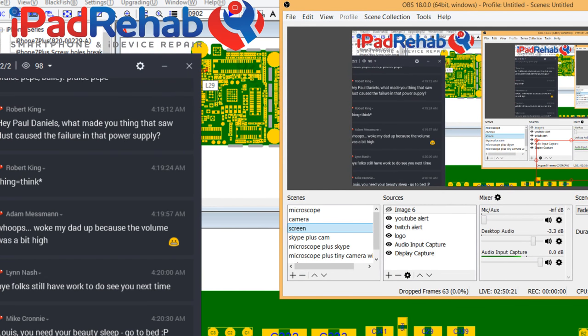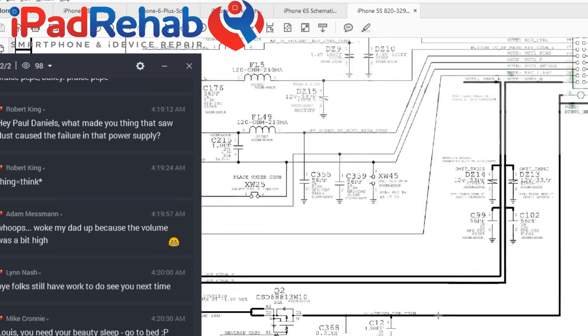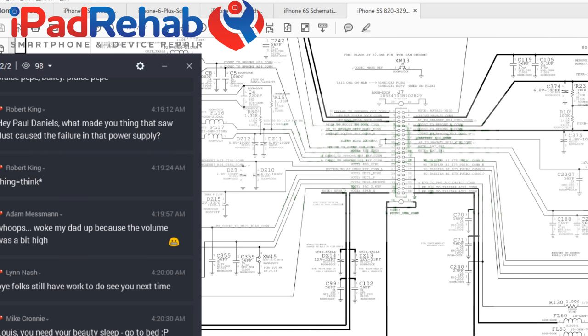So result here is that this phone started out with a straight up TriStar problem, changed TriStar, and the phone charged normally at the beginning. Then we pulled TriStar and we installed one where we intentionally deleted the 3v0 accessory power. Let's look at that screen. The 3v0 accessory power line, whatever that is.